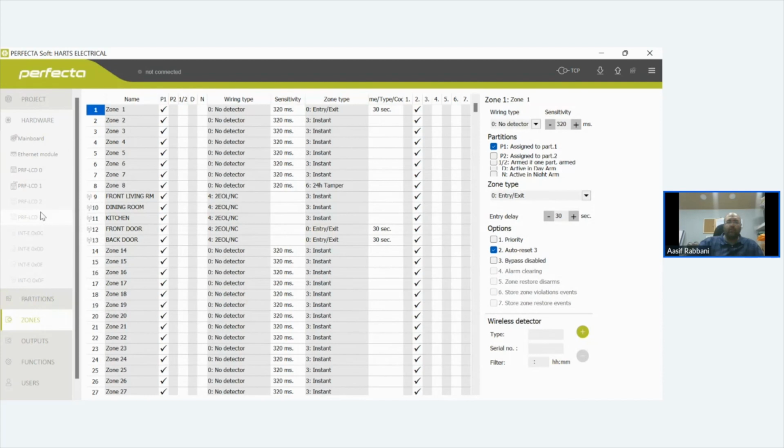It's a hybrid panel, is it? So we went wireless zone, zone 9, because 1 to 8 are on the panel. If you've got a hybrid panel, your panel comes with zones 1 to 8 on the panel, and then all the zones after that are your hybrid ones, unless you've got an expander in there and you wanted to use, like, say, 20 wired zones and 12 wireless zones. You'd put your 8XP, wrong manufacturer, yeah, INTEs on until you filled up your 20 zones, for example, and then the rest will be wireless. So you can just add a wireless zone as you need it.